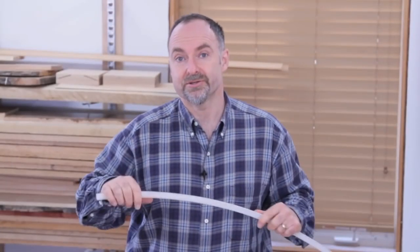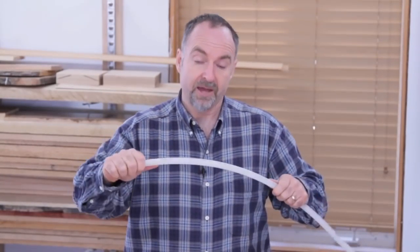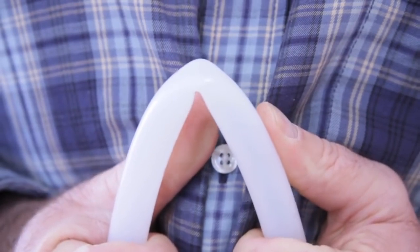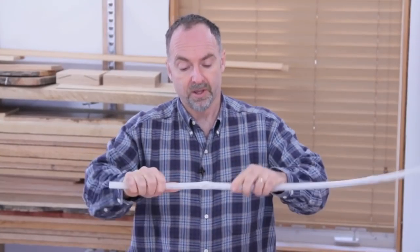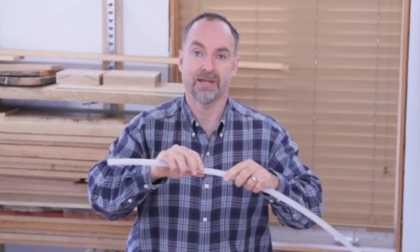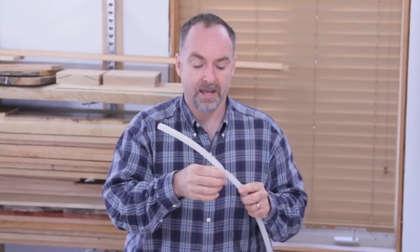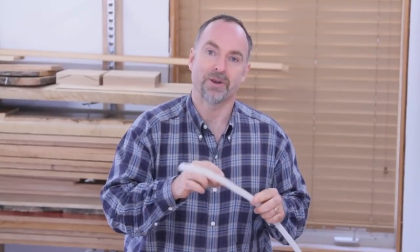One of the challenges when you're working with any kind of plastic type pipe is kinking. Now, PEX will bend quite a lot without kinking, but eventually you bend it far enough and a kink will form. The problem with that is that a kinked area greatly reduces water flow because the sides are restricted in that area. When you're dealing with PEX A type pipe, you can heat that area with a heat gun and completely eliminate the kinked shape. Let me show you how that works right now.